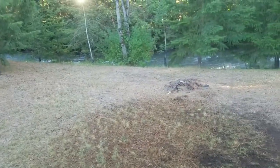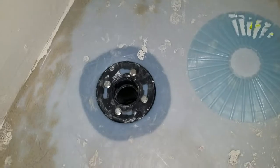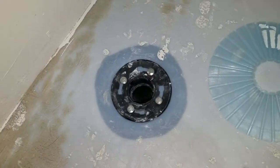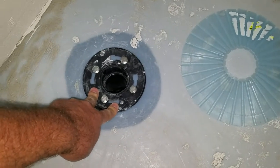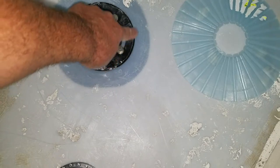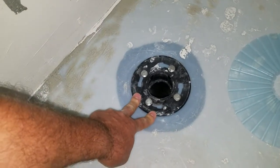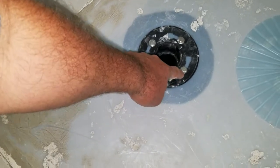There is the river and it looks like it's got less silt in it. We are going to start installing the base system with the sloping sticks for the Dix shower base. This here is a plastic liner that's all welded together. We have the bottom half of the shower drain flange under the shower base, and we put an inch and a half of butyl rubber plus another three-quarter inch wide strip of butyl rubber. Then we set the base onto that and bolted the top half of the flange down to it.